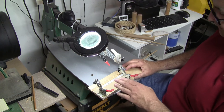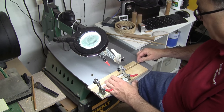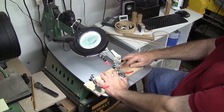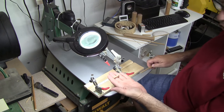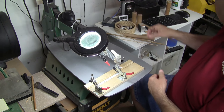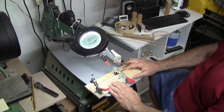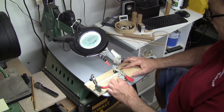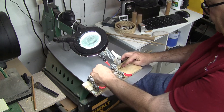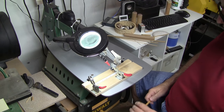You don't have to use either clamp if you don't want to. You can just take your dowel, push it up to the mark you want, start your saw, put a little tension against the metal, and make your cut — and you've got your one-inch dowel cut. You can repeat that accurately by pushing the dowel up again. But the hold-down clamp does help keep the cutoff in place and keeps your hands away. With the hold-down, there's less jumping during the cut, and then you pull the clamp up and slide it over for the next cut.